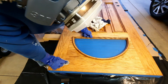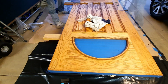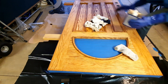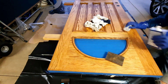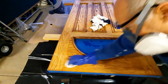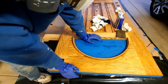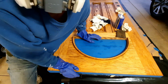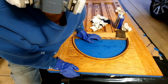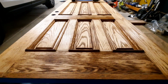We're going to be going with the grain. You can see how quickly that process goes. The afterwash is highly volatile — it dries really quickly. I like to rub it in, rub it off, and then clean it up. The polyurethane finish has been completely removed now. We've applied afterwash and we're almost ready to start sanding.